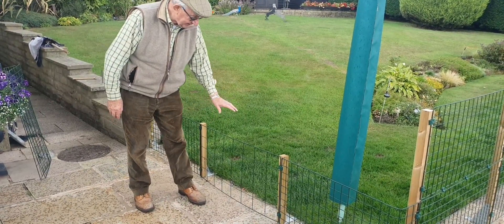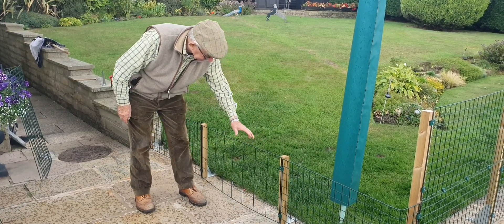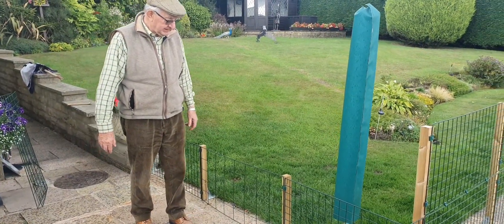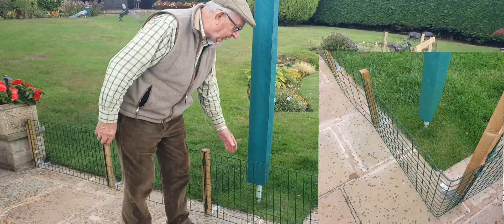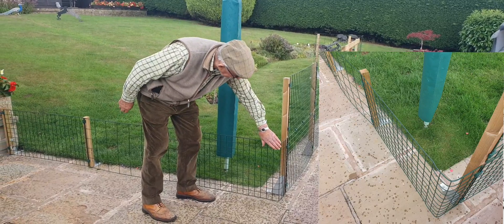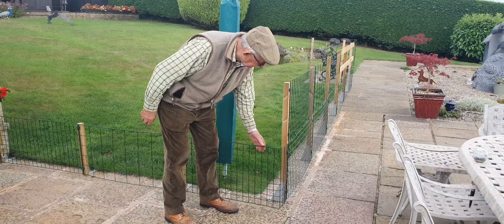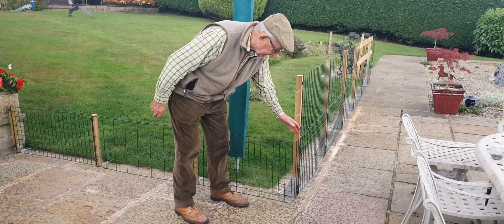They don't like to jump over the top side. We come now to a one-meter panel, but it actually doesn't fit perfectly so we can put a bend on it. You don't have to cut into the panel or damage the PVC coating — you just come around and bend it, and I'll show you how to bend it. It looks quite smart.